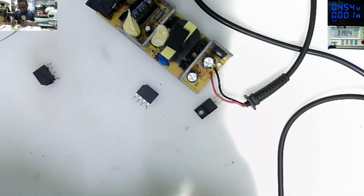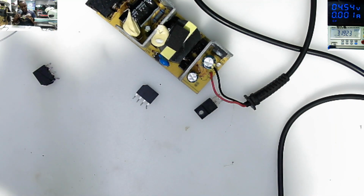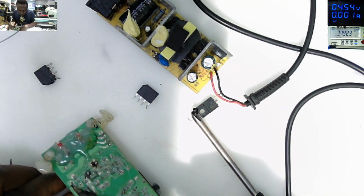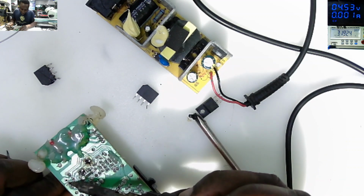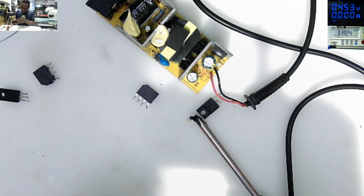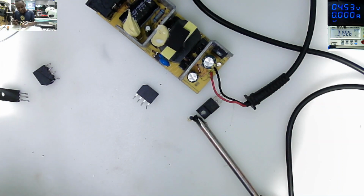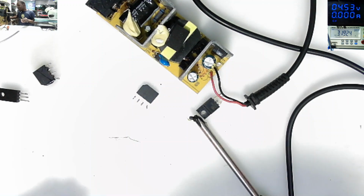That's the rectifier. We also want a Mosfet. We take down this Mosfet. We check. Hopefully these components are good. I will take also the fuse. Today I want to do a proper job. No replacing a fuse with a wire. That's our fuse.